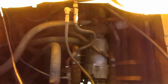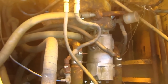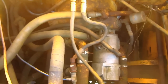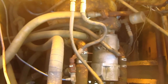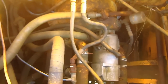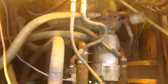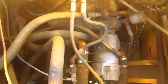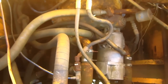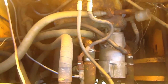Now we're going to talk a little bit about the powertrain on the 475B. From up here you can get a good view looking down at the Clark single phase torque converter which feeds directly into Clark's transmission. The engine drives three torque converter mounted gear type hydraulic pumps, each rated at 78 GPM at 2000 RPM, producing a total output of 234 GPM for this machine.